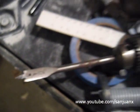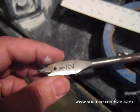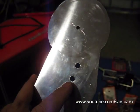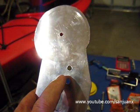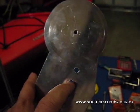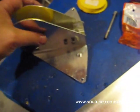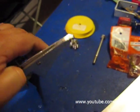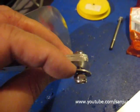To enlarge the hole, I'll use this tool — it's commonly used to enlarge holes or make holes in wood, or you can use it on fiberglass too. I just enlarged the two holes that are used for the cables that will raise or lower the blade rotor. I also enlarged the two holes for the rotor assembly. I just put the bolt there — as you see, it has two washers and a lock nut, which I will explain how this is used later on.